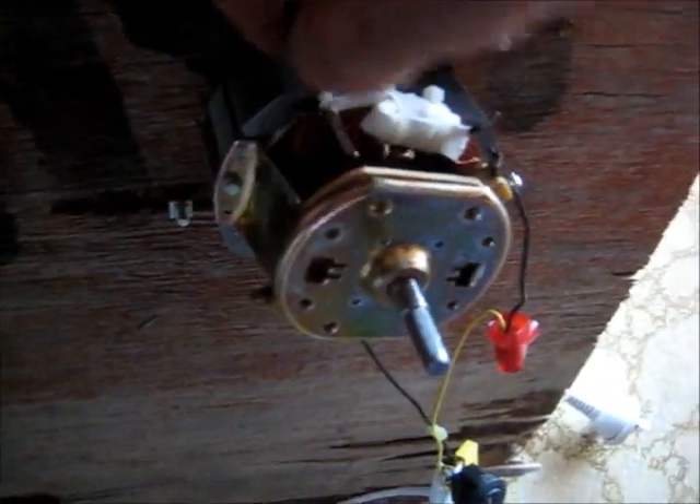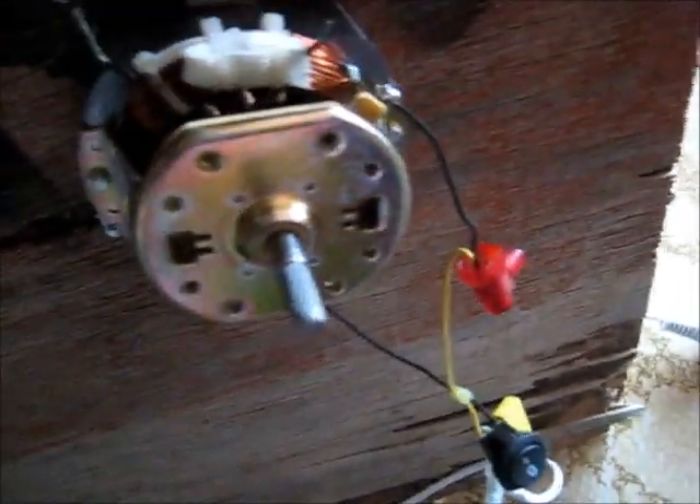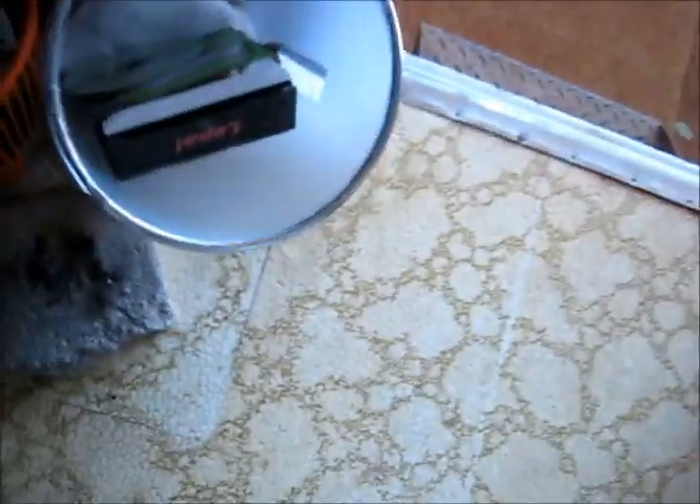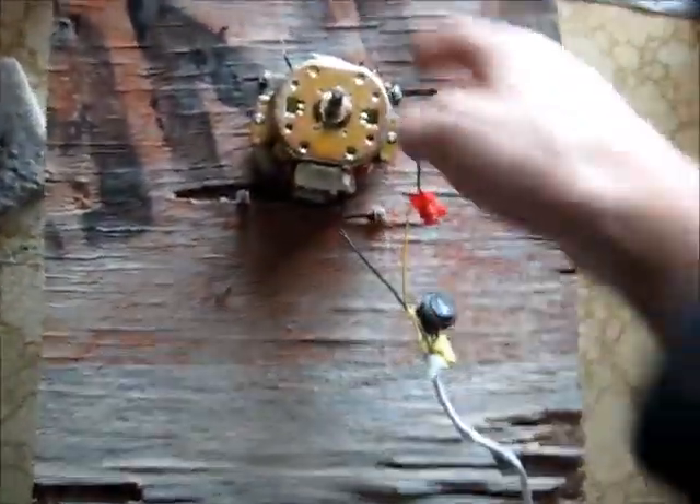If you also want to know — since I've bypassed the field winding on this motor, I've left my connections unplugged. I want to wire up my multimeter to these, see what voltage you get out of this winding while the motor's running. I left the other one connected still, haven't modified it since the last video on this. Plug it in and see what has changed, if we can get the voltage out of that winding. We'll try and short it out and see what other behaviour this thing does — if it goes slower or faster when I short that winding or pole out. The field winding, like I say. Just hook this up.